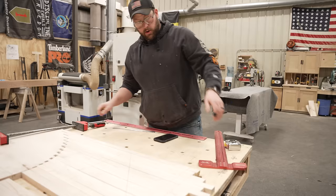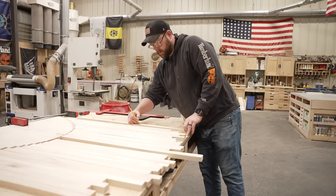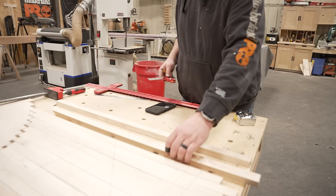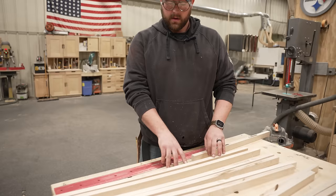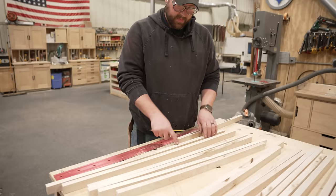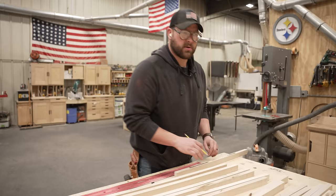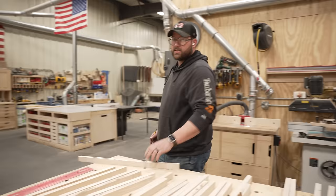Chris did this on the computer, but the measurements are kind of difficult. So I'm gonna try to do it by hand. But if our rod goes through right here, we need a slot that the rod will slide in on the next piece. And so that slot will be here to there. In order to make this work properly, all of these marks here, I need to drill a hole exactly where they are on the outside at the exact diameter of our rod, which is 3/8. That'll have a start and stop hole. I then need to come back and relieve the entire mortise, slot, whatever we wanna call it, with a smaller bit, so then I can come over here and finish it with a 3/8 bit. A little bit nerve-wracking.